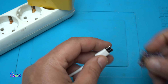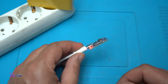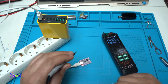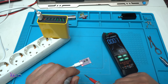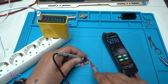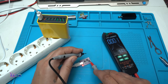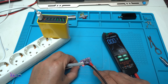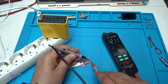I'm going to power the trigger module and measure with my multimeter the output voltage. I'll use my rechargeable multimeter, which is pretty cool. You can check the description below for all products — the trigger, the power adapter, the multimeter. Let's measure the voltage: only 5 volts. But when you switch number one, we get 9 volts now. And if I turn on switch number two, I get 12.1 volts.